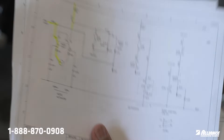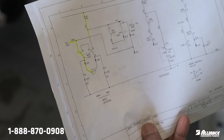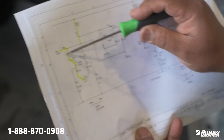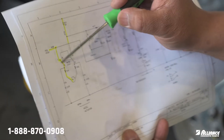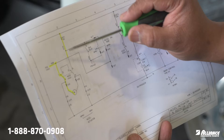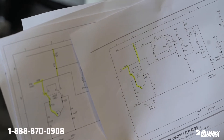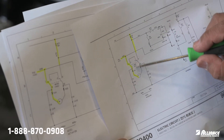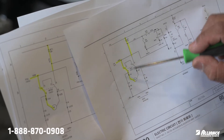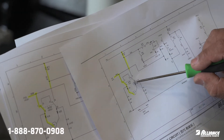In the old system, the signal from X08 will go to terminal number one, which is the one on the bottom, to terminal number one on top and terminal number one on the bottom, which is normally closed. The one for RPM minus is normally open — it won't get active until this wire or this connection gets connected in the relay itself. In the newer system, it works identically. You get power and RPM plus will be connected all the time. RPM minus will only send the signal when relay 4K50 gets active.